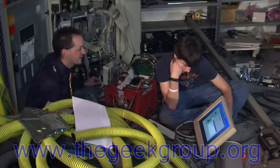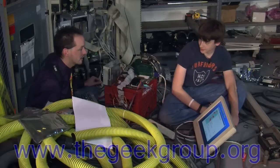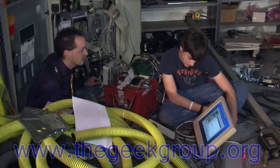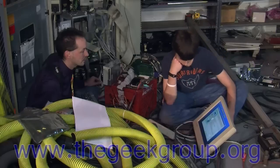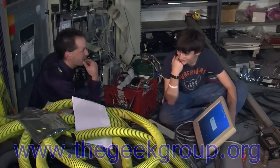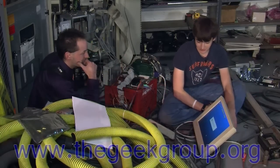Whatever any of that means, we're just going to go Kuka standard. General Motors with operation mode T2. So then it thinks we have a KRC2 control. We do have a KRC2 controller now. There's a lot of stuff that we don't have. I picked options that were names that were kind of familiar and went with that because it had things like MFCIO. Well, that's the MFC, so we'll want that. Yeah. Without that, it's useless.